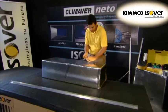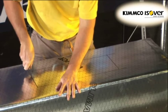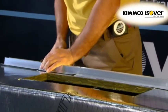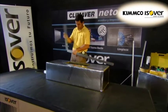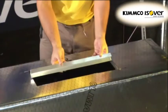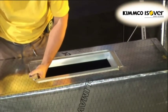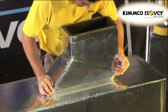The Perfiver H profile is placed on the main duct. The branch is then inserted into the main duct to create a friction fit connection with the Perfiver H. The branch cannot pass inside the main duct as the Perfiver H has a lip on the inside.